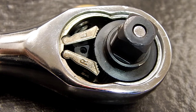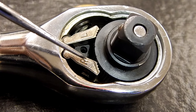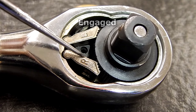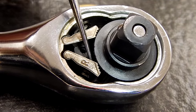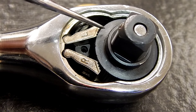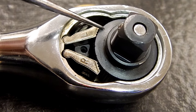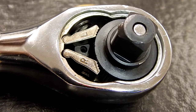Now that we've seen the parts, we can better understand how the mechanism functions. The ratcheting mechanism is dictated by the position of the pawls, which are governed by the position of the center cam. In this case, the position of the cam is allowing the left-hand pawl to mesh with the center anvil, while the right-hand pawl is pushed off to the side. The pawls have a pivot point and springs which allow them to have movement. With the left-hand pawl resting against the main anvil, as the mechanism turns to the left, it will catch — allowing us to turn a bolt. If we go the opposite direction, to the right, it will cause the pawl to slip and bounce against the teeth, thus causing the click.